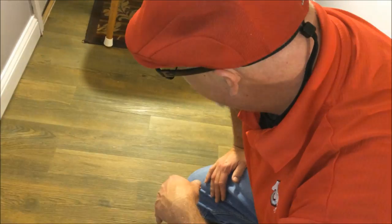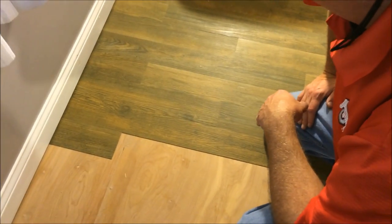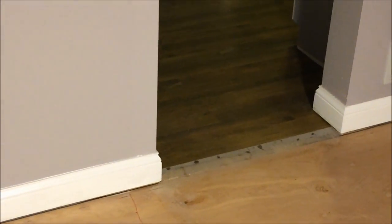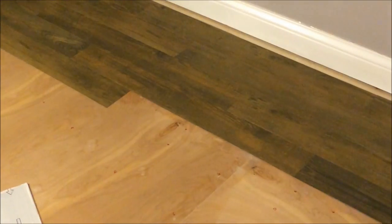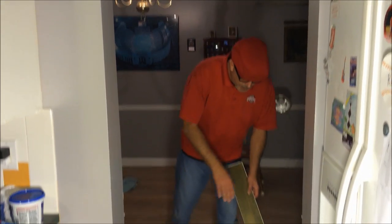After the last piece, I'm not far from making a speed zone for the entire rest of the room, but here's probably the most challenging aspect I'm going to have to work with: flowing from one doorway along this baseboard into the other doorway so that everything seems seamless and I stay on my marks and lines going throughout the house. The idea is to continue laying this way until I get here, where there'll be a piece. I didn't really want to cut in the doorway but I'll go ahead and do that — I'll have to backfill that after I bring pieces along here. It looks like it's probably going to be about a three-inch piece, so I'll be cutting off about an inch.